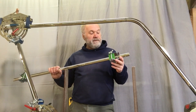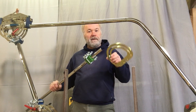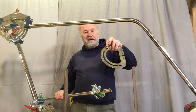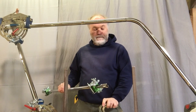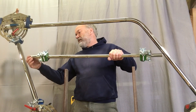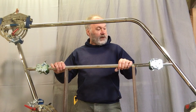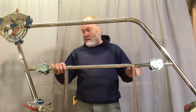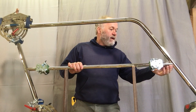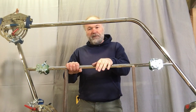Here's the tube after notching on the abrasive notcher. I've taken these angle guides off but left the clamp halves on. These have a stop to re-index them if you want to put them back on. It's always good to leave these on until you know you've got a good fit. There's no end-to-end play and the fit-up is looking really good. This one's done.